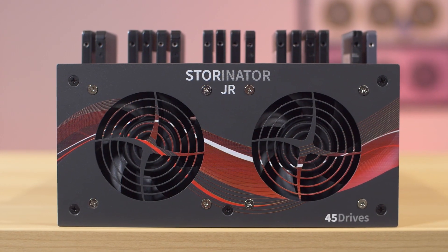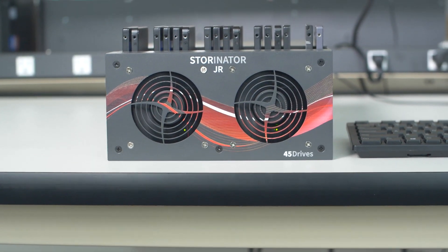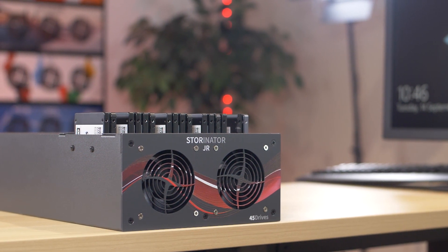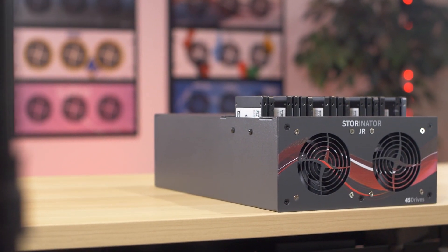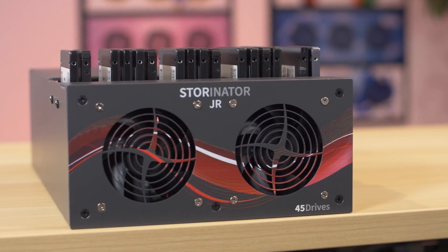For this to be an actual product for us to sell, we would need to validate that the bottlenecks don't impact it enough to not be worth it, and also probably redesign the case — the drives sticking out isn't really a good design. It was mostly just because we thought it would look kind of funny if they're sticking up out of it like a top-loader. Taking how the SSDs are mounted and rotating them sideways to load from the front, and figuring out a way to make it more portable with a DC power input instead of AC, possibly allowing it to run off a battery pack at remote locations.